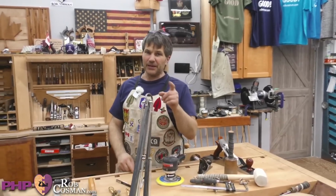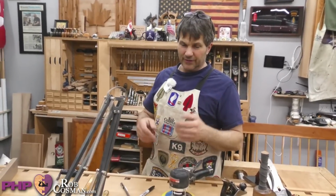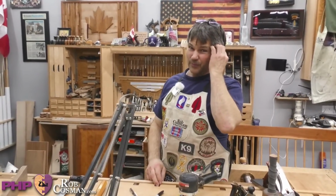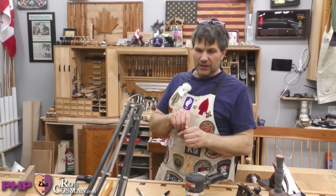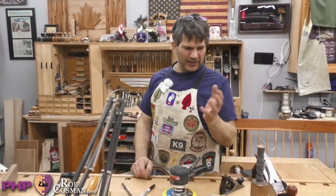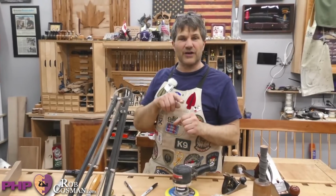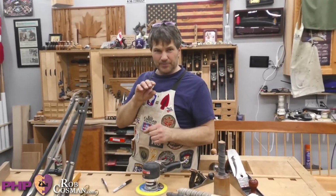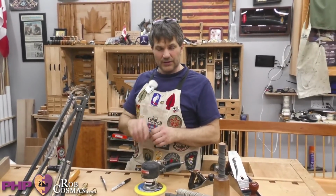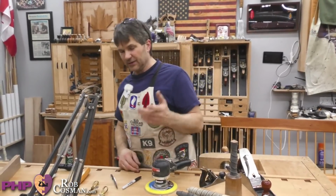You can even wrap a piece of paper around the inside of the joint or around the dowel. It's wood, right? To give it that little bit of extra. Or if you want to be even better at it, I would drill the hole out. I would probably go up a size. Depending on your application, maybe if it's a 3/8 inch hole, drill a 5/8 inch hole, put a solid 5/8 inch round dowel plug back into that hole, and once that has dried, go in and drill your new hole. That's going to give you some alignment issues, but it's all doable.